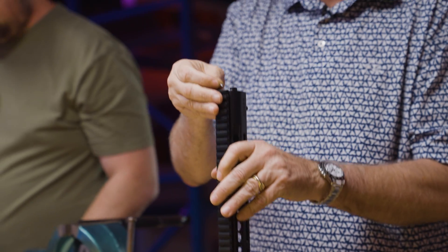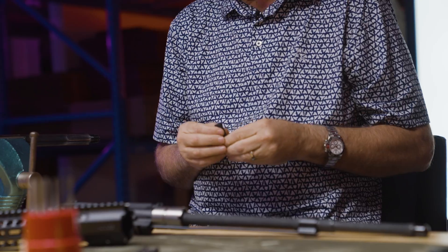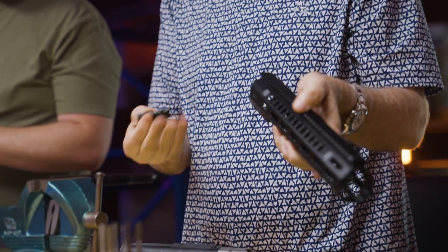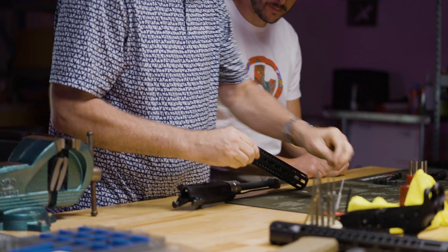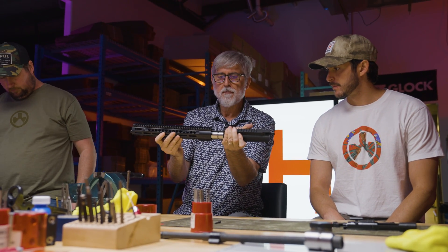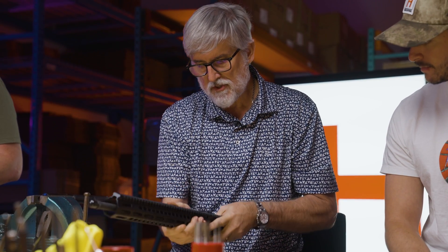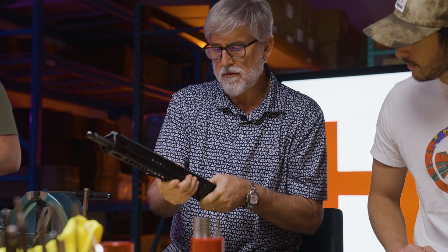These little solid stainless pins go into a hole at the 12 o'clock position on the upper receiver — they'll drop in there. Then we're going to load the hardware — the wedges. These are designed so that as you tighten them up, it creates height in the wedge. It's a locking mechanism that's ridiculously strong. We're going to put the wedges in, take the two short screws, get them started, and slide it over onto the barrel nut. You'll start feeling a little bit of tension, and there's a corresponding hole on the upper receiver that the anti-rotation pin goes into, and that's it.